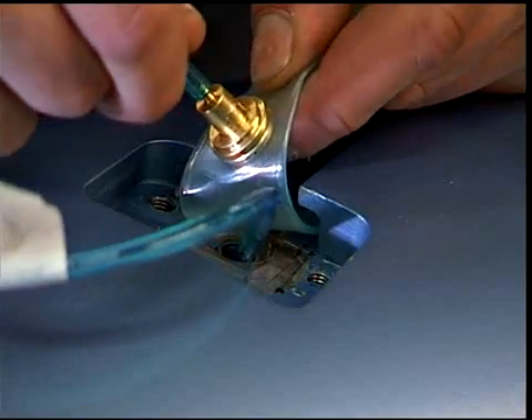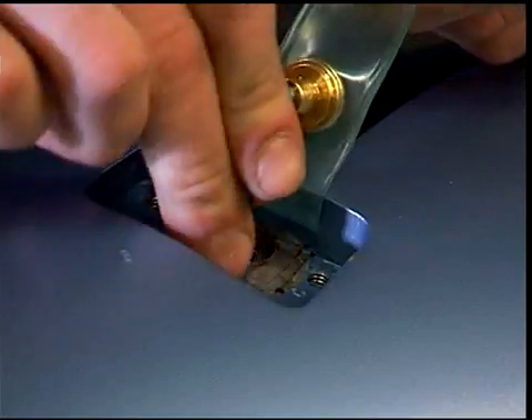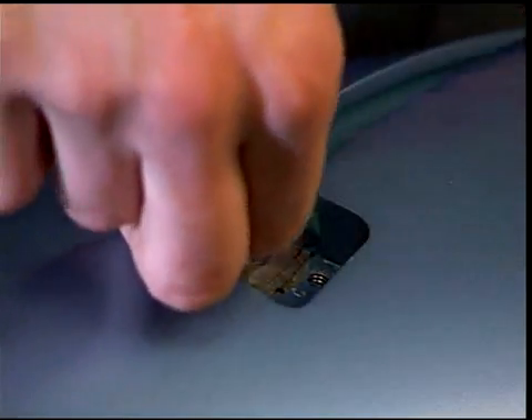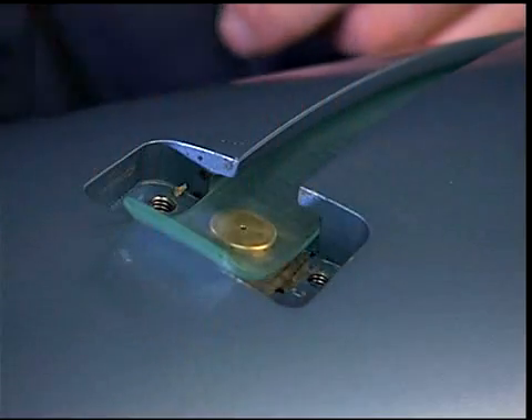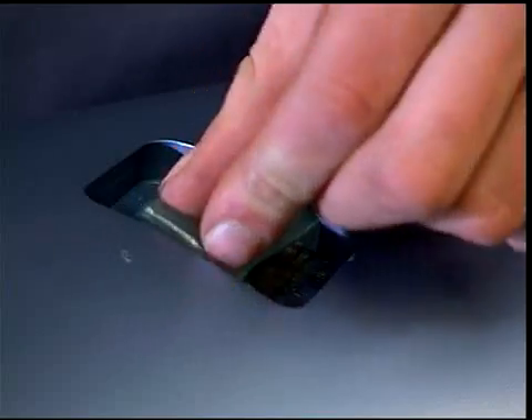Attach the barb fitting and the air hose. Seat the air fitting into the counterbore hole. Fold the air fitting end of the bladder so that one half inch of the end of the bladder can be tucked under itself when placed into the slot.